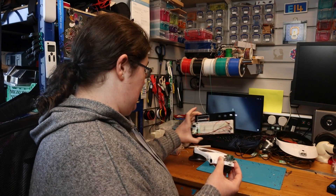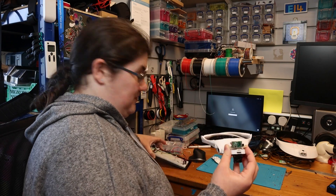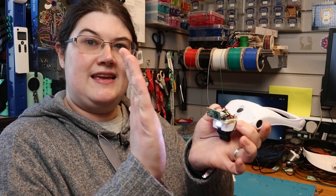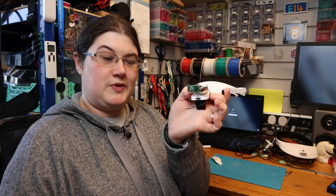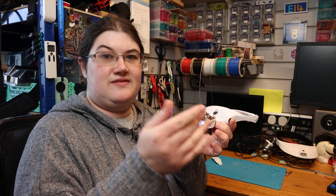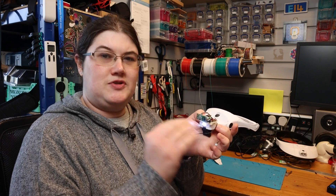When I had it on the breadboard I was using my adapter to power it off 3.3 volts to check that it would power off the LiPo okay. It worked fine then, but now it's actually on the circuit, the light is flickering. It's working correctly — when the distance is too far it's off, and when something's close it's on — but it's flickering. The comms from the sensor is reading the distance correctly, but I'm not sure about the LED. Let's have a look at it on the scope.